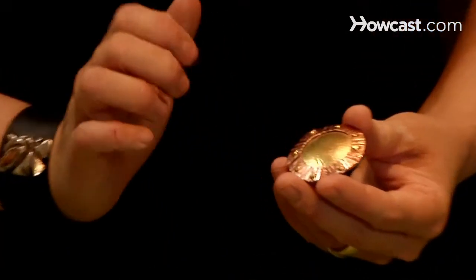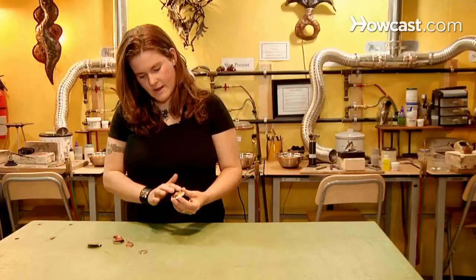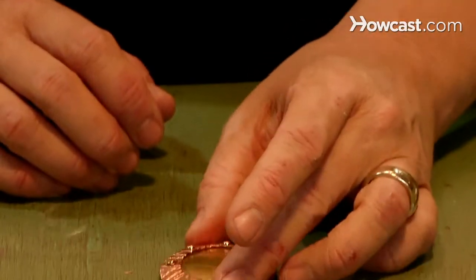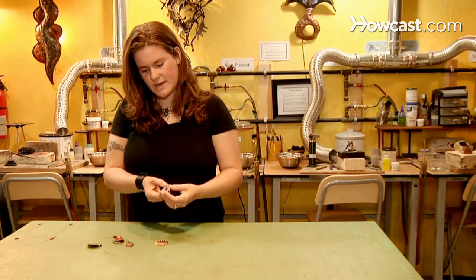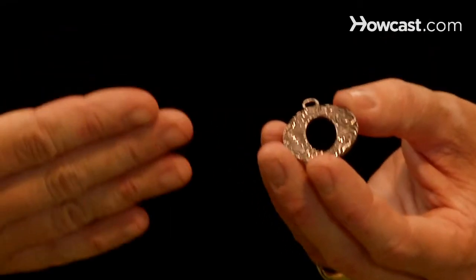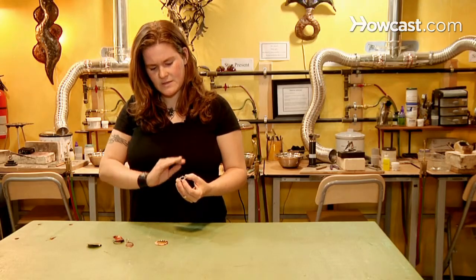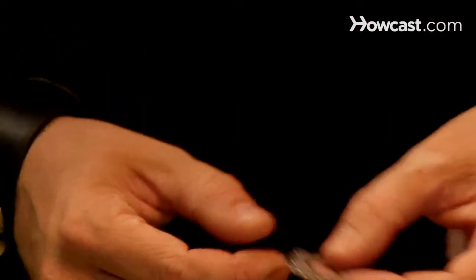Here's some examples. This has a very light texture on it, a brass, and then a heavier hammered texture around the edges. Play with these different textures and see what kind of look you like. Precious metal clay lends itself more to texture as well. You can actually use stamping tools to create texture in metal and in precious metal clay. There are a ton of different ways to get texture on your piece, and really quick, fun ways as well.